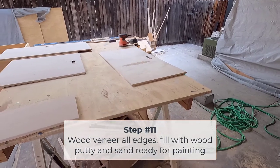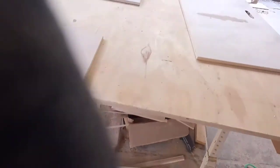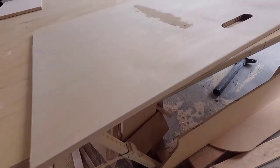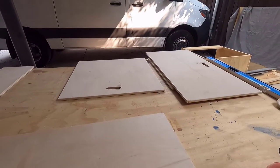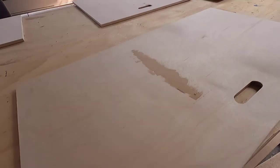Now that I've cut all of the pieces for the dinette and edge stripped all the edges that need it, and routed a little hold there with a half-inch router run through twice, I'm just sanding them back and getting them ready for varnishing and painting.